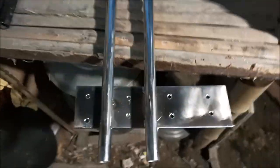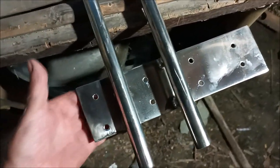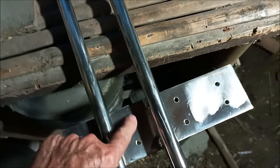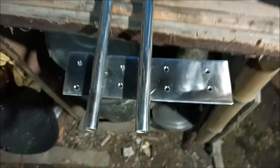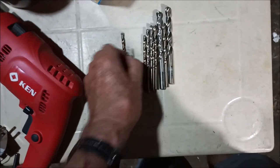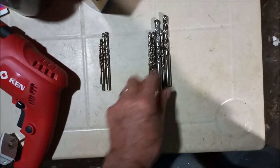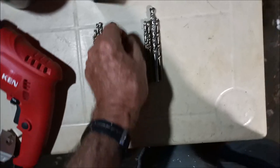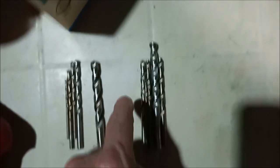I've got all these polished and I roughed up the back a little bit, but the 40 grit roughing process didn't work that well. In the meantime, I've drilled holes in the stainless, and I hate drilling stainless — it is just a royal pain. I have to use all these drill bits. I start out with a little one-eighth inch drill bit, then I'm up to a quarter inch which is the final size I want, and then I take a bigger one and countersink a little bit because my screws are countersunk.